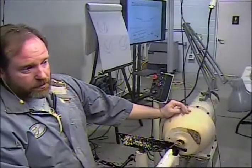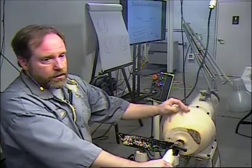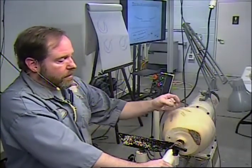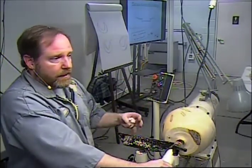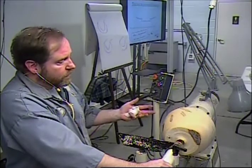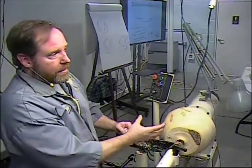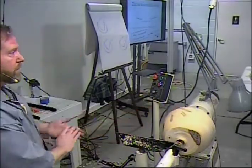Number one, I think it's easier to turn than a recess, a mortise. I believe that it's a stronger surface for grabbing a piece of wood. And third, I personally, as you can see from the table, I like a foot on my bowls. So if you create a tenon, you're halfway there when you turn this back around to create a foot. So it gives you that extra piece of wood.